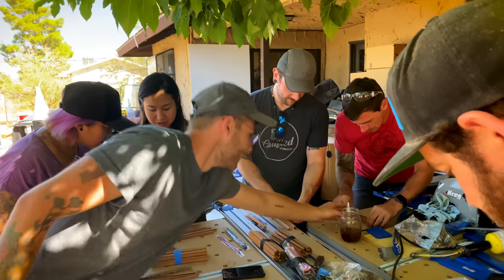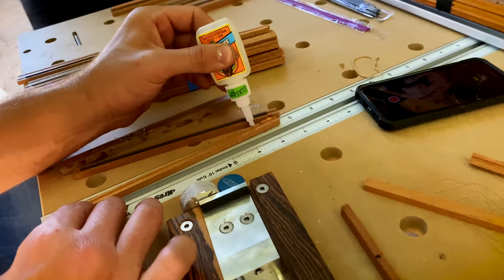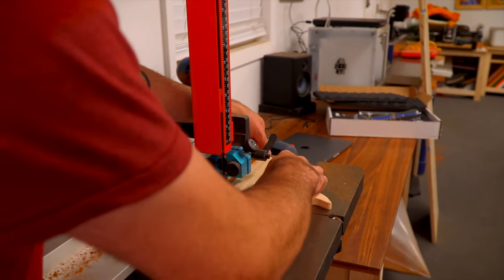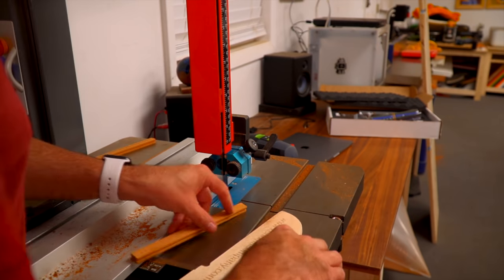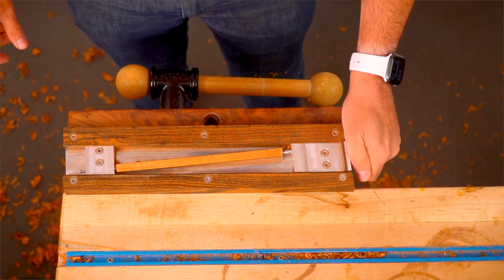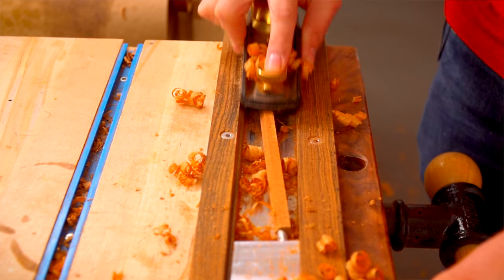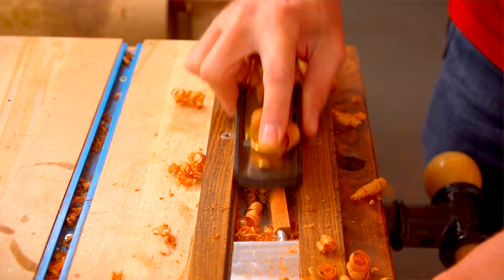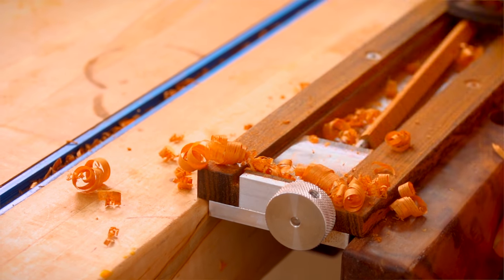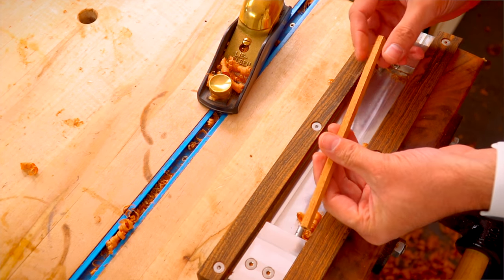The way the jig works is you cut an eight inch long by three eighths by half inch blank. Then you route a groove on both sides of that blank with the bit that comes with the jig. You then split that in half, drop in your lead, and glue that together. Once dry, the blank fits into the spring loaded jig and has six positive stops. You plane down one face until your block plane bottoms out and then turn the knob until it clicks onto the next stop. Once you get all six sides planed down, you can pop your finished pencil out and sharpen.